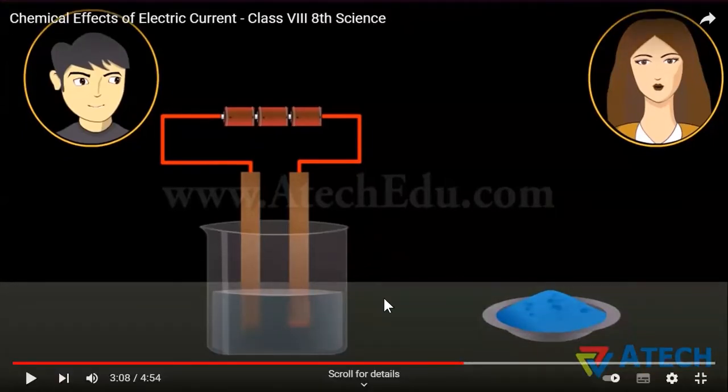Look here. He asked, what will happen when the copper sulfate from the electrolyte, from the solution, disappears and is finished or used up? Then this copper anode will also release its copper into this solution so that the balance remains. Otherwise the copper in the solution would finish up. So this copper will release its ions into the solution; that's where the balance is maintained. Look here, that means copper gets transferred from one electrode to another.